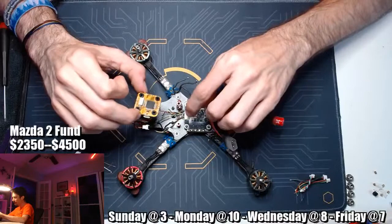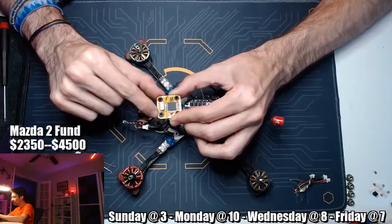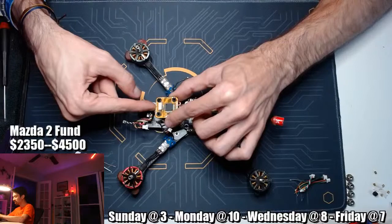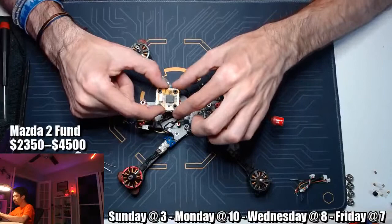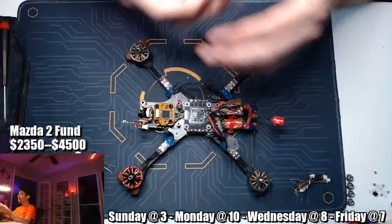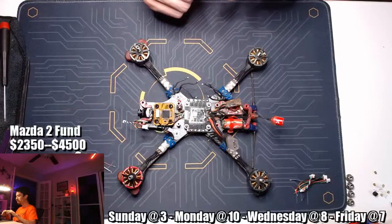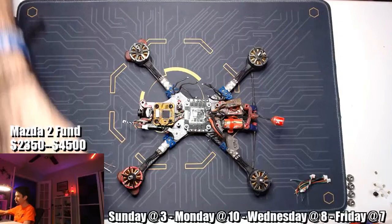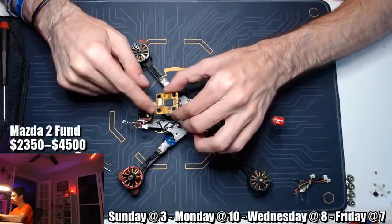The next thing to think about, I always try to mount this so that the video in is on the front and the video out is on the back, because no matter what, you're going to have to feed the camera in to the front of it, and then the VTX is going to be in the rear of it. So it really helps with cable management and having the shortest possible run on your video line to keep it from being noisy. You want to keep your video lines as short as possible because they are prone to picking up electrical noise. One of the ways to do that is to put the video in pads on the front, video out pads in the back.